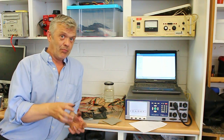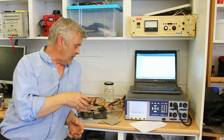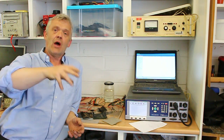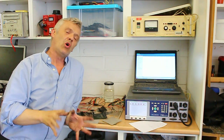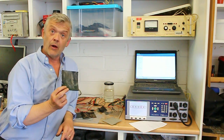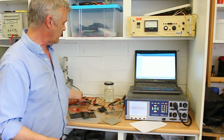Lead acid is about 33 watt hours per kilo. Again, bear in mind, I'm not taking the top end of this. Now, we've done this calculation quite a lot, and it turns out for us and these devices, despite the fact that it dropped down under a volt for part of the time with an above a volt for a part of the time, it's more or less 1 milliamp equals 1 milliwatt for devices that we're doing. So we've got a really easy conversion to go to milliwatt hours. So we're looking at about 35 watt hours per kilo on the old tyres. And that's what we saw on that graph. And that was obviously quite exciting for us.